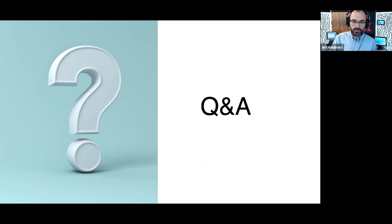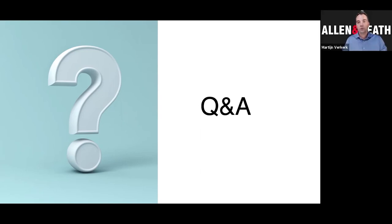Very good. The other question we had earlier in the presentation on the IP controllers is about IP addresses, and specifically, can they work with DHCP? And if so, when would you recommend using DHCP or a static IP address for the controllers? Yeah, so the controllers can work with DHCP. You can tick a box and then they will use the IP address allocated to them. In most installs, I would recommend you to use fixed IP addresses simply because you then know which IP controller has which IP address. The IP slots are assigned on the naming. So the name defines where they get their information, but still it's recommended to use fixed IP addressing.